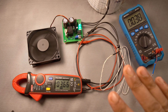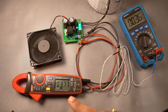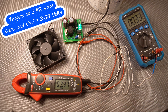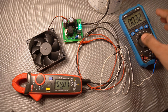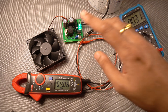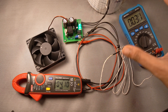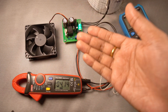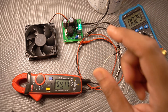I'm not fast-forwarding — this is real time. As the heat sink cools, V_sense climbs back up. Very close to 3.8 volts now — and yes, the fan switches off at 3.8 volts exactly. This proves the hysteresis: the fan switches on at one point and switches off at a different, higher point so it doesn't oscillate.